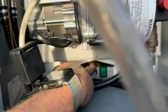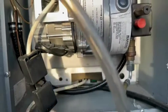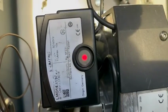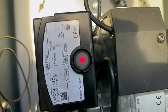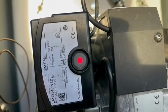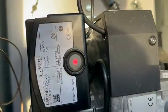So I've turned up. As you know, it's a Wallstar. I've got my ladder out and I've got the cover off the boiler. This is actually a combi Wallstar - the reason you know it's a combi is if you look under here, you've got an additional green switch there. So if we look here, you can see there's a nice red light on, which means the board is in lockout. When you get that, it means it's had a burner failure or lack of fuel - those are the only two things it can be. On this electronic box, we push the button and it will flash, and then as soon as it fires, you should get a solid green light.